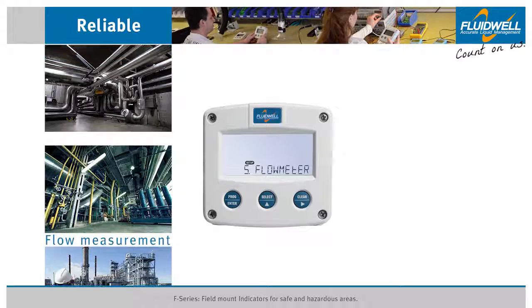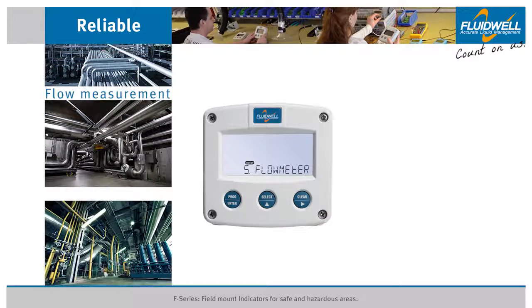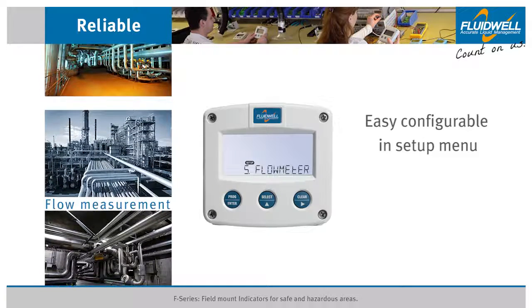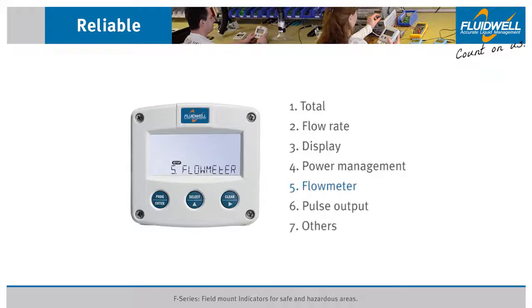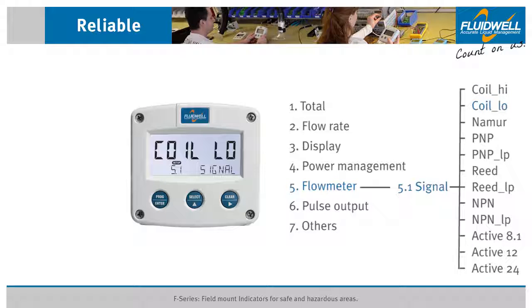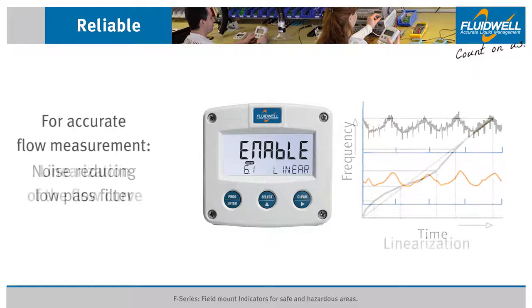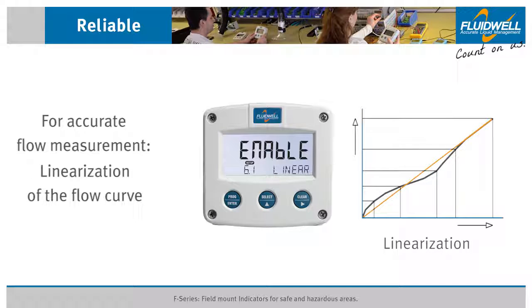For flow measurement, the F-Series accepts most signals from almost any flow meter. The various pulse input signals are easily configurable in the setup menu, like coil, Namur, PNP, reed switch, NPN, or active input signals. A noise-reducing low-pass filter or linearization of the flow curve are available for more accurate flow measurement.